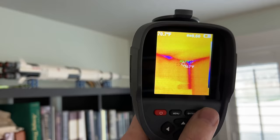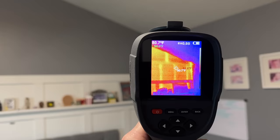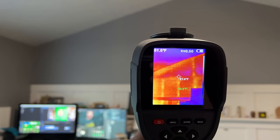A little bonus tip: a thermal camera is actually a pretty great stud finder. It depends on the wall, but if you've got outside temperatures on one side, or attic access — like walls along your attic or in your basement around the outside — this can do a really good job. I can see vertical studs going up, a top plate, and triangle structures holding up the roof. The thermal scanner shows studs as slightly colder by a couple of degrees. These start at about $140 for a phone add-on and get pricey — this one is about $400 — but they're handy for a million things.